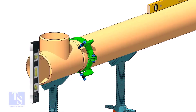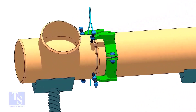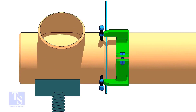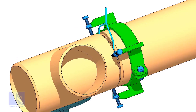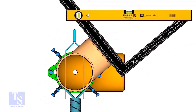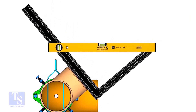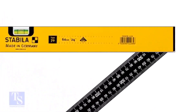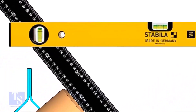Make sure the overlap and the gap are equal around the joint. Rotate the T in the required direction. Put the right angle on the T face and hold the level bottle on the right angle. The bottom edge of the level bottle shall pass through the markings. Rotate the T, holding the right angle and the level bottle firmly, until the level bottle is in level.